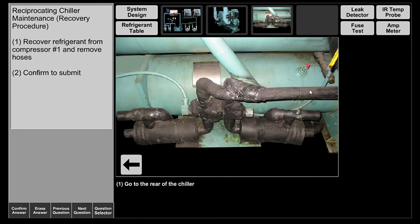Now remember, you have to understand that this liquid is high pressure, high temperature subcooled liquid — liquid that was just converted from a high pressure high temperature vapor to a high temperature high pressure liquid. Now after this, the cycle is going to go through your filter dryer.